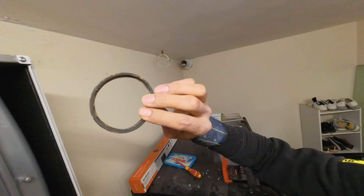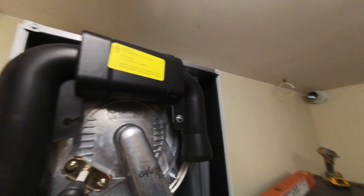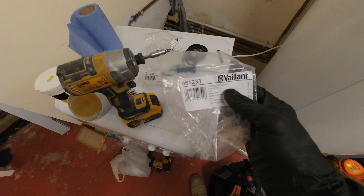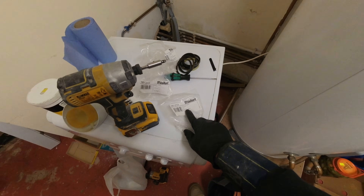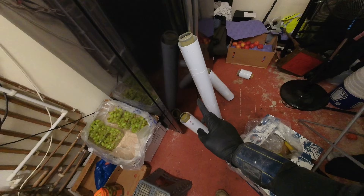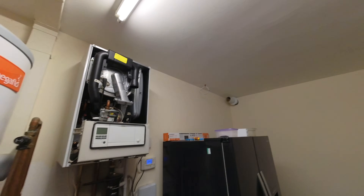So it's not bad enough that we need to replace the whole flue. I'm going to replace all of the flue seals — make sure every seal has been replaced, everything's intact. I'll change the flue seal in here as well. I'll count up how many I need, replace all the flue seals, pop it all back together, do my flue integrity check, do my 26.9 checks, and if it's all good, we're out of here. Six flue seals have been replaced — part number 981233, that's for the 60mm flue seals. Let's get it all greased up and then get the flue back in.